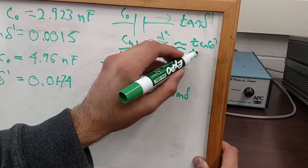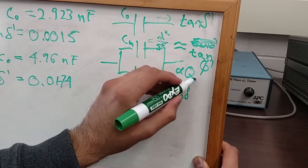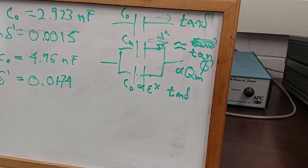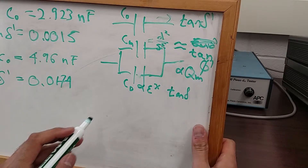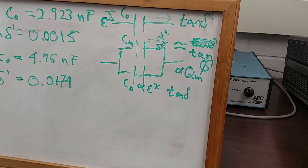The clamped capacitance loss is related to the piezoelectric losses, which in turn relates to the mechanical loss — proportional to the mechanical quality factor, tied to elastic properties. In high power resonance type applications, elastic loss properties are the most important consideration because we have large vibration and large stress, but not necessarily large electric field applied. Therefore, we have much more elastic energy stored than dielectric energy stored, so we want to minimize elastic losses.